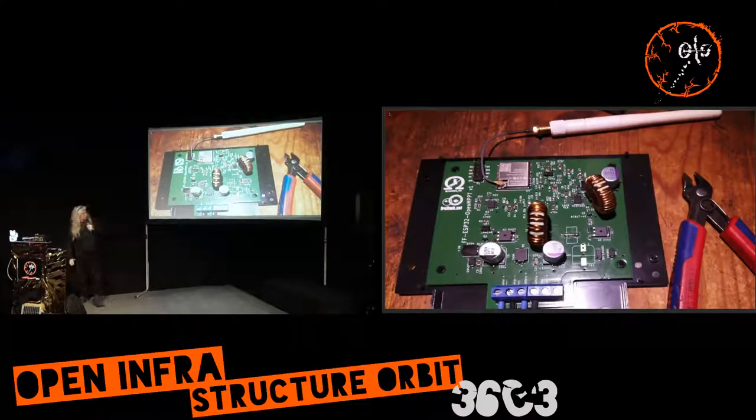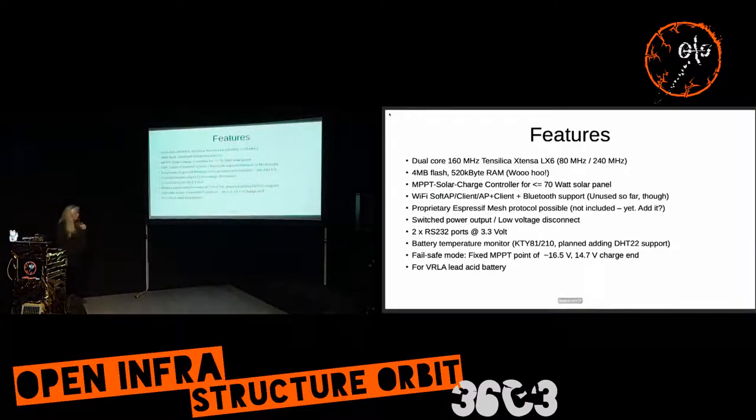Here's a photo of the new hardware. It's an ESP32, so it has all the features of an ESP32. By default it runs at 160 MHz. I've tested it — the throughput between two clients at full load is 1.3 megabytes per second, but with debugging turned on, so without debugging it's probably faster. At 240 MHz it's probably faster too. The device has 520 kilobytes of RAM. The sky is the limit — well, it's not that amazing if you consider that OpenWRT today wants 64 megabytes of RAM minimum, so 128 times more RAM.